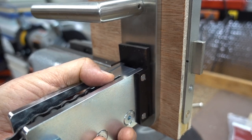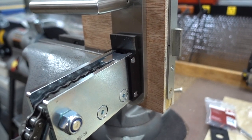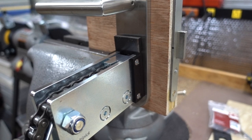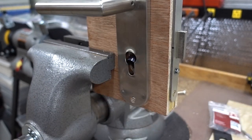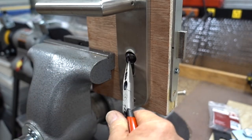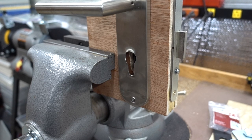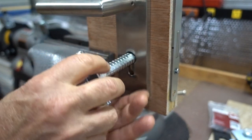This is the one for the Euro-style cylinder. Just kind of hang them right up there. You'll notice this fits around the lock body, and there's a distance between it and the face plate. What will happen when we put our tool on there and start prying — it will put pressure on this plate, which then transfers to that lock body, not to the face of our well-used test jig. When I press down on this handle, we will either pull out the core — in which case we'll take a screwdriver and turn the actuator — or if it's a weaker, less expensive lock, it might even break the spine and pull the whole cylinder half out. And in this case, we ended up snapping the cylinder. The actuator popped out right here. So all we've got to do is take the key, slide it in there, and turn our actuator to get the door open.